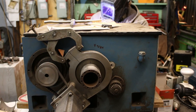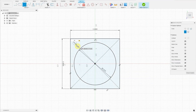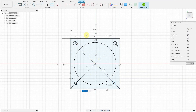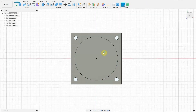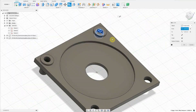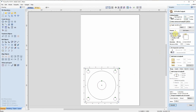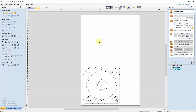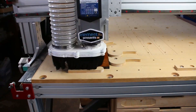For the motor and controller we ended up with a closed loop system — not that we needed it, but it was what was available to us in the torque requirements we needed. We needed to electrically isolate the stepper motor from the gearbox, so I designed a spacer made out of a piece of phenolic we had laying around, taking into consideration the thickness of the spacer so that the timing belt pulleys would still line up. I also added plastic bushings so the bolts holding the motor down are isolated as well. After getting all the tool paths created, I carved it out on my Avid CNC router.